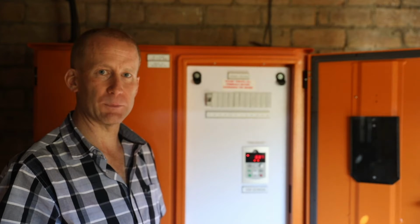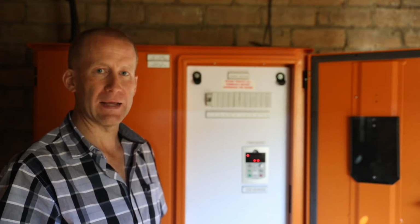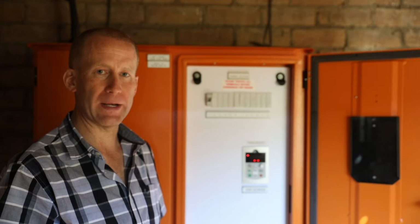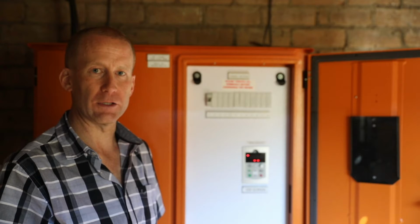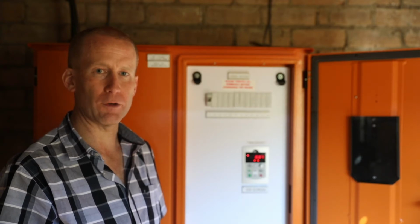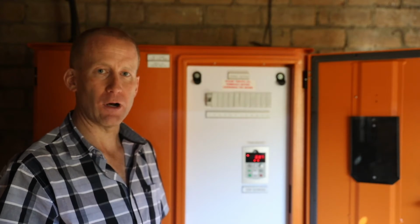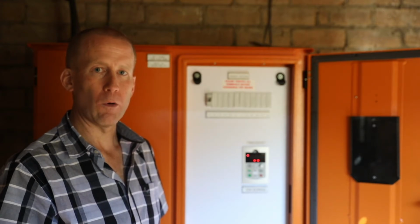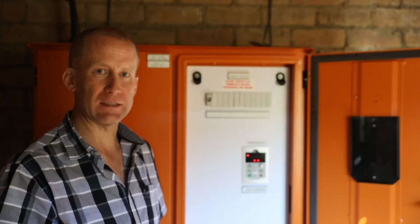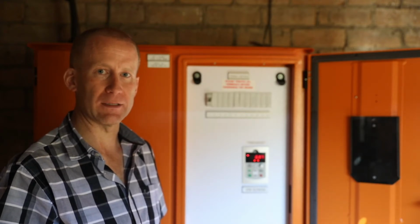The VSD must then be programmed to give an analog output corresponding to the power consumption of the VSD. That analog output should be a 4 to 20 milliamp analog output. Some VSDs allow the range of the 4 to 20 milliamp analog output to be set, while other VSDs have a fixed range of 0 to 2 times the nominal power of the VSD. Whatever the analog output range of the VSD is, that corresponding range must be entered into the Pivot Optimizer.